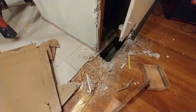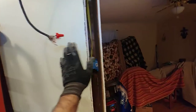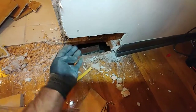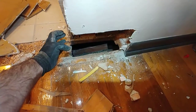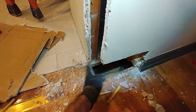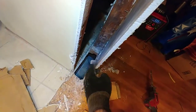Now here's where we have a bit of a problem. Battery's low so I can't use the flash. I wanted this wall — when we take it out, go around the corner — we thought about showing the brick of the chimney here and going flush around the corner. The problem was there was a hot air duct coming in right at the edge, so I was thinking I'd have to add a 2x4 to the other side so you can get around it and put the register cover on properly.